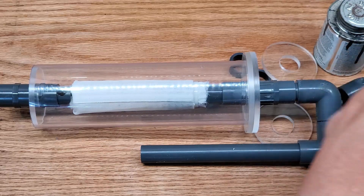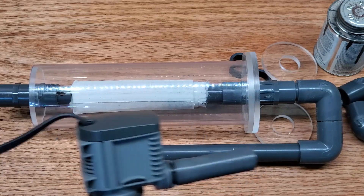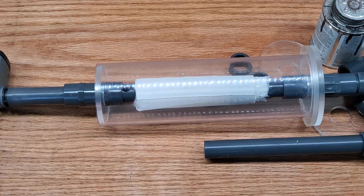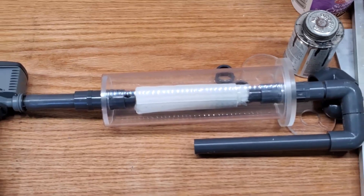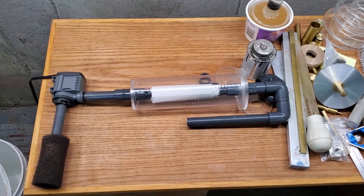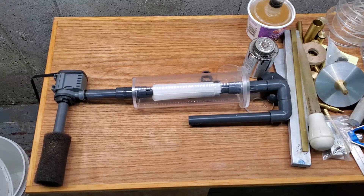So this is how it's going to fit. This is the return pipe — the water is going to go up through, it's going to swirl around, it's going to pass through the diatom powder and the screen and then return into the tank. I'm going to put a bracket on this just to keep everything where it needs to be, and obviously the bottom is going to get welded in place. That'll make things a lot easier. I'm going to shorten that pipe as well — that pipe is a little too long. I want to keep this as compact as possible and it definitely has to be under a total of 18 inches for what's in the tank itself. From the top of the friction-fit lid to the bottom of the pump has to be under 18 inches because that's the smallest size tank I think I'm going to be putting this on. If I'm going to put it in a client's tank, it has to look like it actually belongs there.